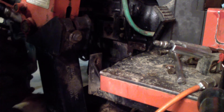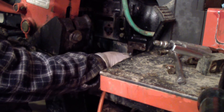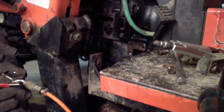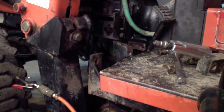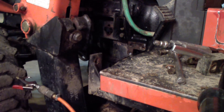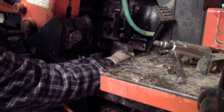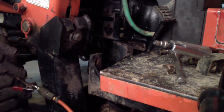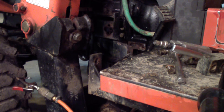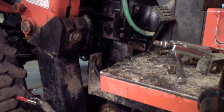Normally I would drill it a lot deeper and maybe a lot bigger, but it looks loose so I'd like to try it as a small tap and see what happens. It's too small. You also have to watch that if you do go too small, be very careful because if you crack one of them off in there and break it off inside the bolt, you ain't drilling that bolt out. That's where you want to be real careful because it's hardened steel.